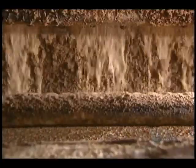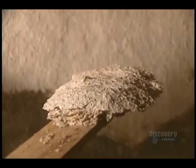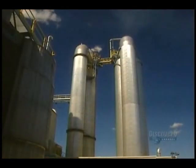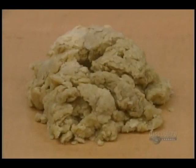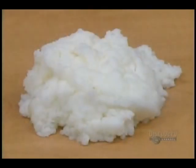Exiting the washer, the brown paste is washed and sent to the thickener. With this spatula, they verify the quality of the brown paste washing. The paste must be bleached. This alkaline extraction tower places the brown paste in contact with chemical products. It's bleached with chlorine dioxide and gradually becomes more white. Then the water is partially drawn off.